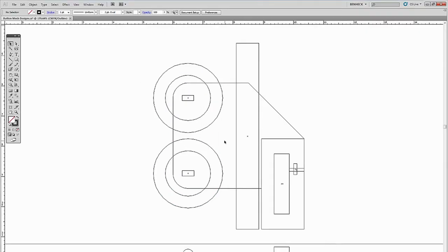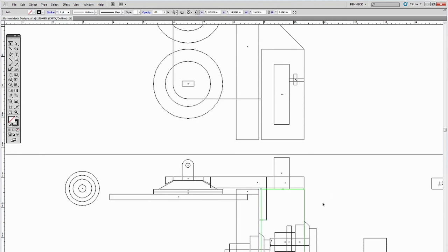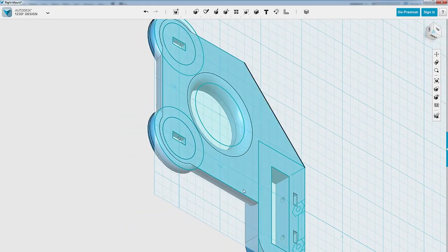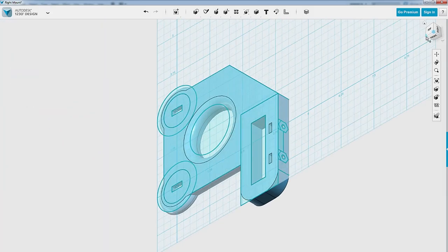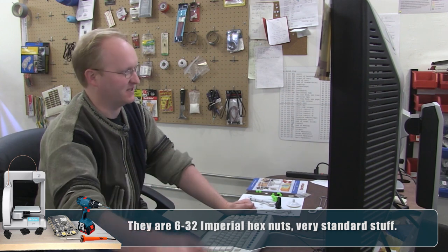This is a top-down drawing of the full mount. Two suction cups prevent rotation; holes are for tabs and a slot on the side is where the buttons go, with adjustment up and down via set screws. There's a large hole in the middle to save material. Most of the detail is on the bottom so we'll print this upside down. Suction cups go here and here, and there's a space inside to implant hex nuts so a screw presses against the sliding tab to keep the buttons in place.